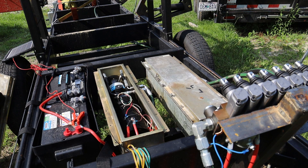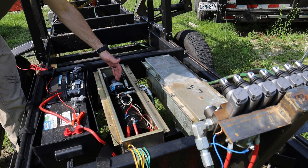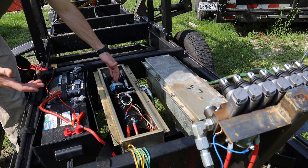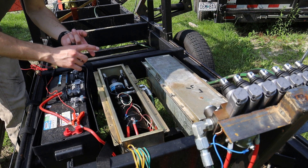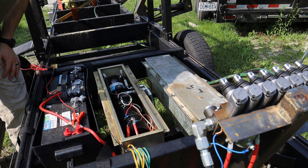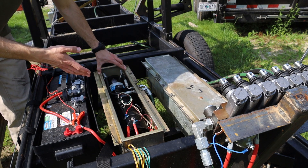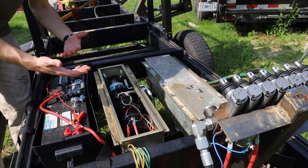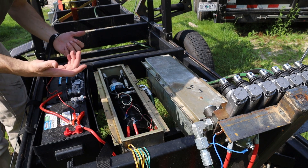Instead of KTI, I found these Monarch pumps. They were made in Michigan — I'm pretty sure they're not made anymore, but you can still buy their products through different suppliers online, and there are plenty of PDFs documenting them. They're really common in industrial equipment like hydraulic sky lifts and Wood Miser sawmills. These particular units were used for army targets — double acting pumps that would raise and lower the targets.